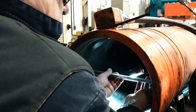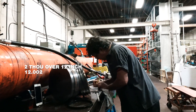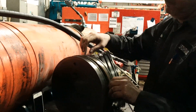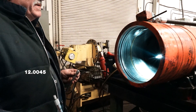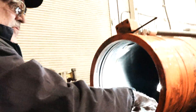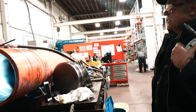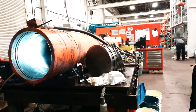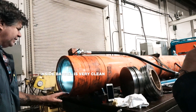I've got 2,000 over 12 inch — 12.002. Same, I got 12.0045. That was a tight fit I just did there. So it's probably varying a little bit the first bit here. Which makes sense because it looks like a different pattern that you're buffing in. Well, it's as clean as one I've ever seen. As far as internal damage, it's super clean. Yeah, it looks good.